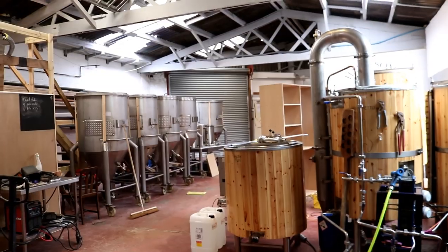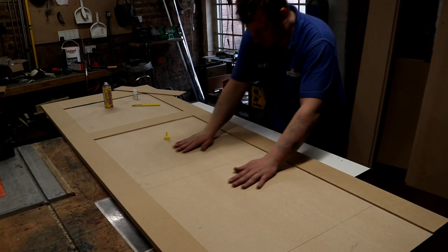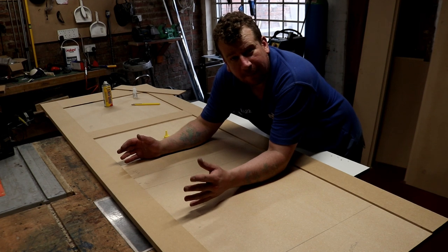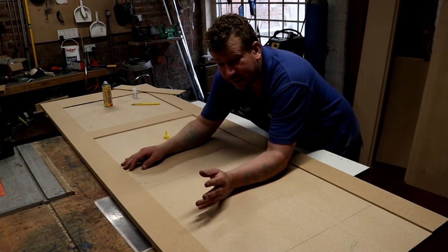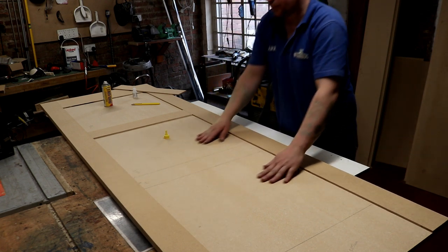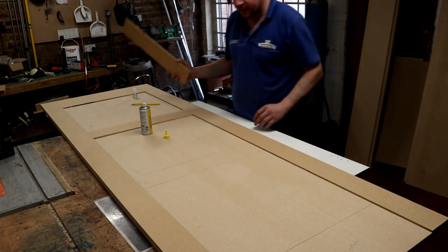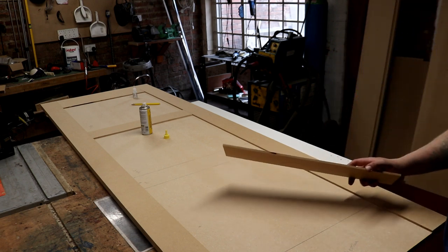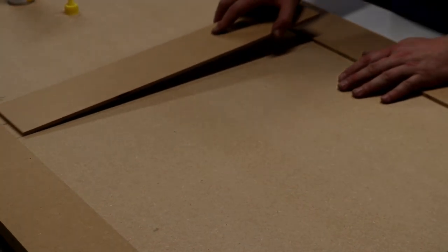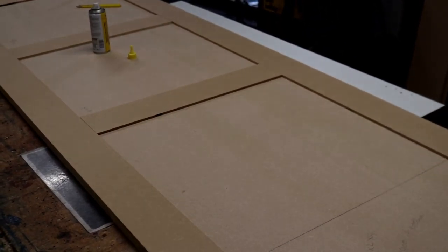I've been cutting and sawing away, folks. To make these shaker-style bedroom sliding doors, I've got a tip for you — I got this off YouTube, I think the channel was called Essential Craftsman or something like that. If you just search for shaker-style sliding wardrobe doors I'm sure it'll come up. Let me zoom in and show you exactly what we do. I've cut all the pieces — this is 6mm MDF and this is 18mm MDF. All we're doing is putting inserts in like that to make the door actually look like it's been raised and panelled.